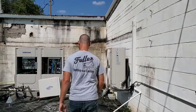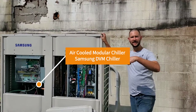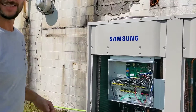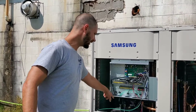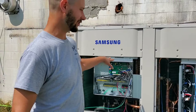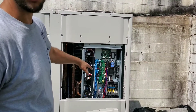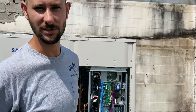You've got to be trained before you can actually install this stuff. This right here is the heat pump chiller. It's got an air-side heat exchanger, and it's got a couple of brazed plate heat exchangers inside down here. This is the hydro controller box — it controls the water side. This right here is the inverter control box. These are the inverters that control the two BLDC scroll compressors that go from 20 Hz all the way up to 160 Hz. They modulate capacity based on the demand.